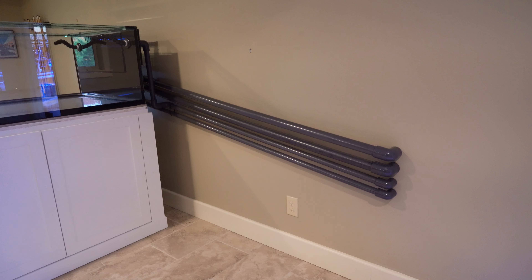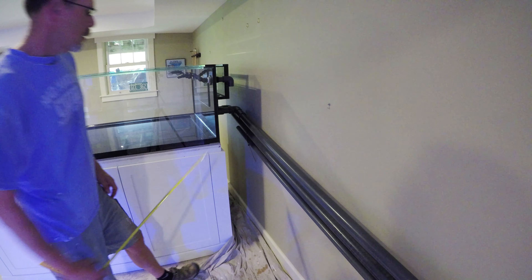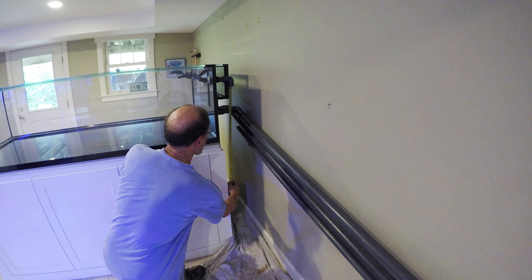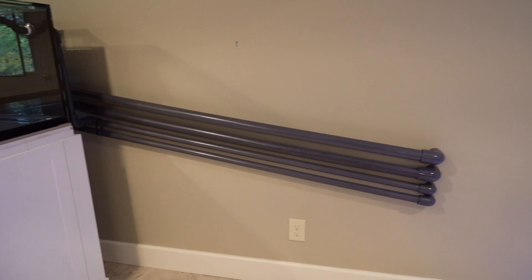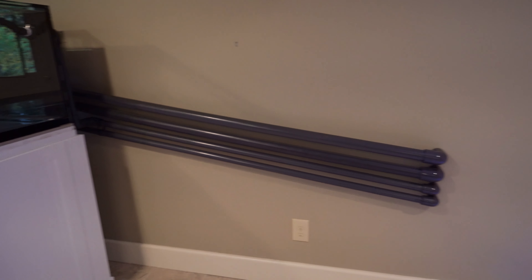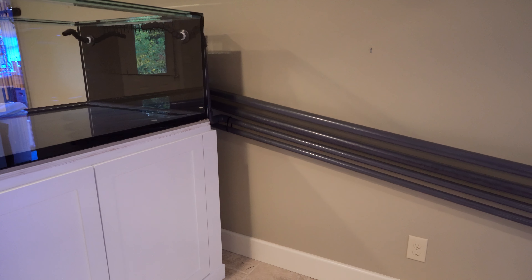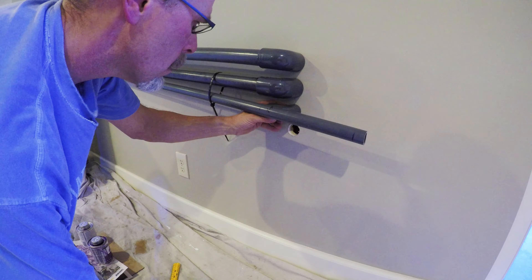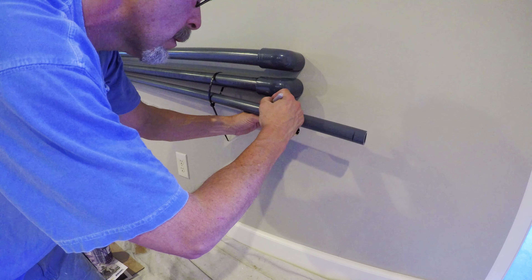This was not easy. You have to do a lot of planning. You have to think about this stuff. As you can see, the PVC pipe here is at an angle. I wanted to make sure I had the proper pitch to go through a couple of different rooms back to the Dreambox. Obviously you need that for the drains — you want gravity to do its thing. You really need to take your time, measure, and also take into consideration the angles.